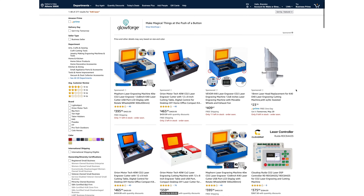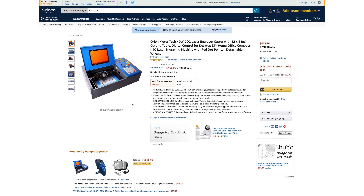So let's do a quick overview of some of the other lasers that are out there. Probably the most popular one for the maker hacker community is something people like to call the K40. There are actually a bunch of different versions — it basically just means it's a Chinese import that's 40 watts. Orion is probably the one I see the most. These are good, but if you get one, you're going to have to do a lot to it more than likely and things are going to break. On the good side, you're actually going to learn how the laser works. You're probably going to have to replace and add parts, and they're usually less than $400. So doubling the price of a much less powerful diode laser gets you up to 40 watts, but you're going to lose safety features, reliability, and you're going to have to tinker a good bit.